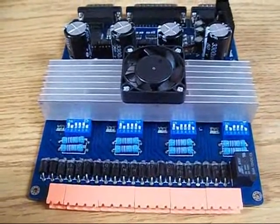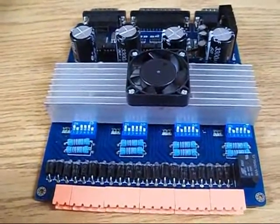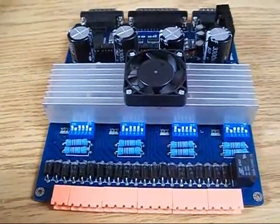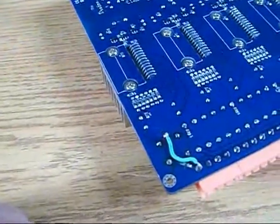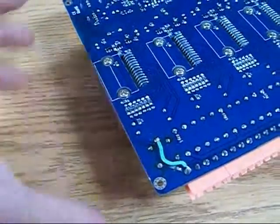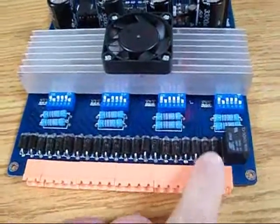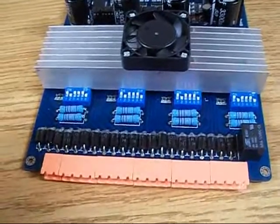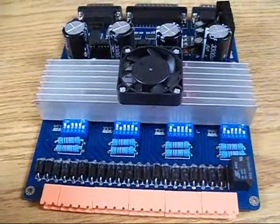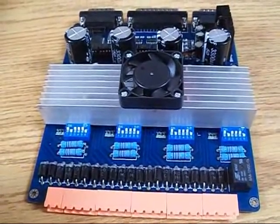I'm going to post some still photos of the repair I've done to this board. The relay has to be desoldered off the PCB, two traces need to be cut, and a jumper wire needs to be soldered in. After the fix, these two pins become active when you turn the spindle on or fire the torch, and open when you shut it off. Take a look at the photos and hopefully this helps if you're having an issue with this board.